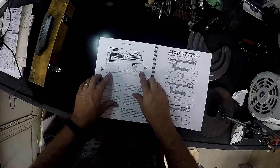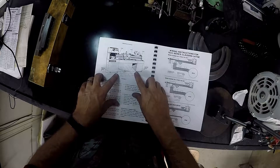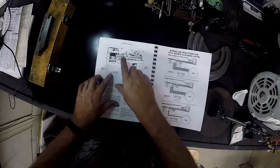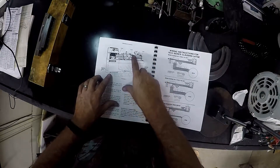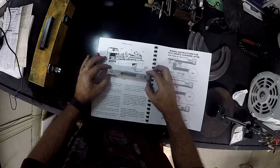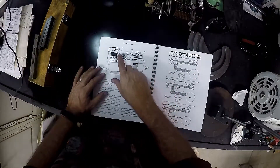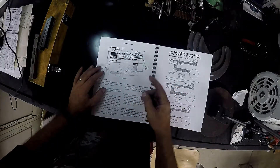According to the book, I level it with these outside bolts here. The inside bolts are just called inner support screws. My plan is to put a couple of levels on it — I've got this one here which is pretty sensitive, and I'll use it for the horizontal. Then I've got a better machinist level I can use for the crossways.